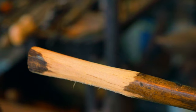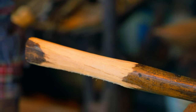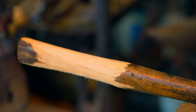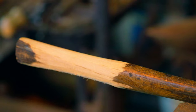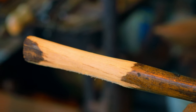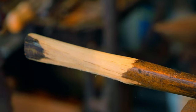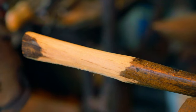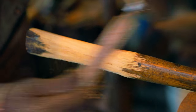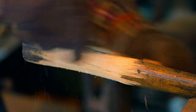Even if you're grinding steel, or in this case wood — obviously the wood is flying away really fast — either way you really want to keep the disc moving and don't stay in one place too long. You get a sense, whether grinding or sanding steel, that you can feel the surface through the disc sometimes. If you keep it moving, you get a sense of where you're at and can feel the high spots and the low spots. Don't want to overdo it here, so maybe we'll take it down a little bit more, then try it out and smooth it off when it's feeling more comfortable.